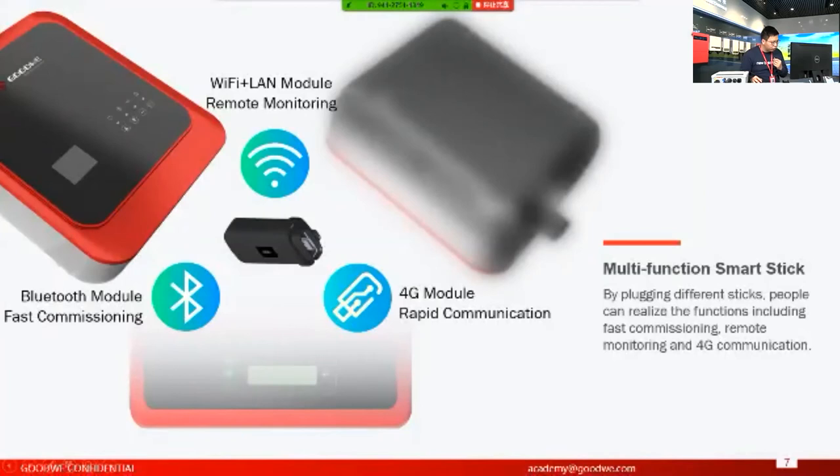Another module here is the Bluetooth module, and I think both Simon and Jack have already introduced something about this one. In the residential application, the Bluetooth module is used for fast commissioning, okay? If I'm an installer, in the future I can bring a Bluetooth module with me as a tool for quick commissioning. When I complete the wiring of the inverters, I can simply plug the Bluetooth module into the inverter and use the smart app to do a very quick commissioning, okay?